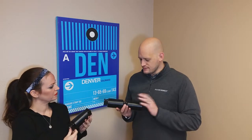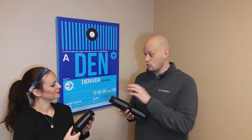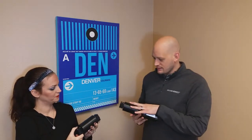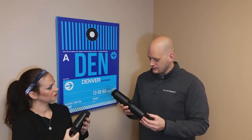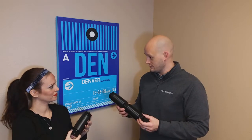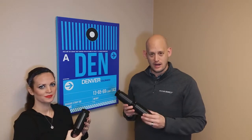Okay, great. And when you have this particular material, the UHMW, what color does it normally come in and why? Well, like a lot of composite type materials, it's easier to make it in dark colors, because anything that is white has to be bleached or somehow made that color. This is what we call a regrind, and you can see there are little speckles of different colors. What that essentially means is they've taken all the different material, ground it up, and put it together. It's not recycled in the sense that it's used, but it is a more natural way to put it together. It in no way impacts the quality, and that's why we like this, because these are expensive and customers typically need hundreds if not thousands of them. So we want to give you the most cost effective option, as long as we're not compromising on function, which these do not.